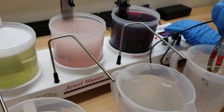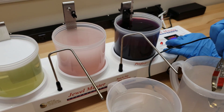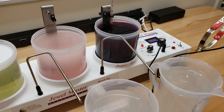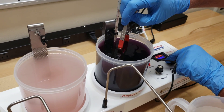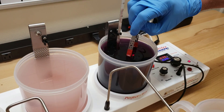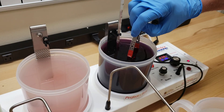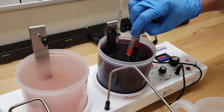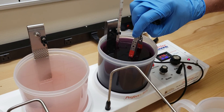We'll rinse and rinse, and now we're going to go into the actual plate. For gold plating, we want to be at about 2.8 volts while plating, so I'll set it to 3.5 because once we put it in, it will drop. So we put it in — it's now at 2.5 — I'll turn it up to 2.75. 2.7 to 2.8 are really the sweet spot. You could leave this in here for 5, 10, even 15 minutes — the longer you leave it, the thicker the gold gets.